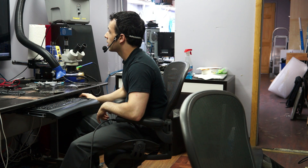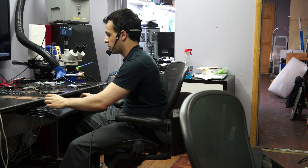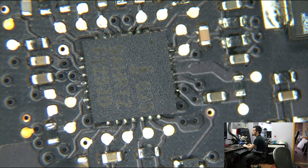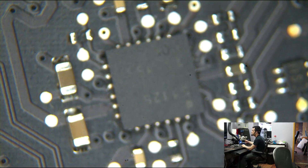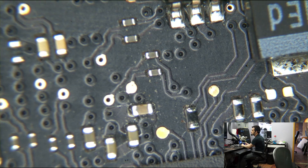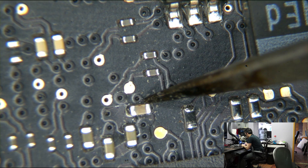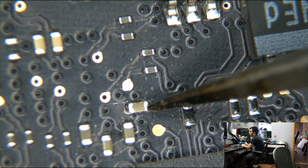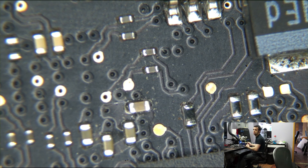I want to start off by going over a couple of things. When you look at this board, one of the first things you'll notice is that it looks pretty clean. You look over the ISL area and this does not look like something that was damaged by water in any way. You look over the other primary areas of the board and it looks pretty good. Going by the SMC, it looks pretty good. There's one cap over here that's kind of sticking up — probably some physical damage from shipping — and you can see where the board trace over here is kind of messed up.